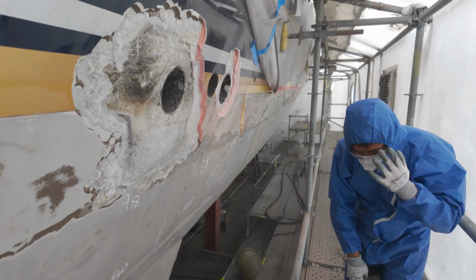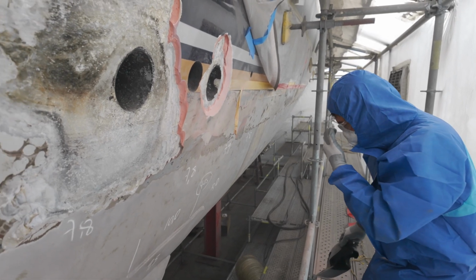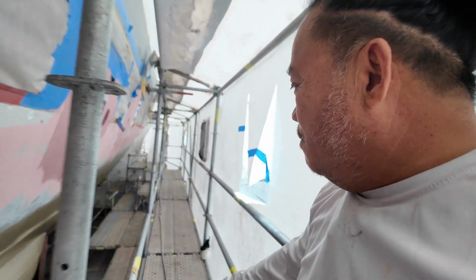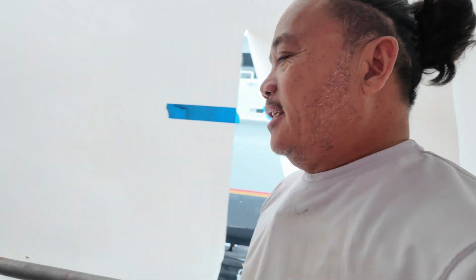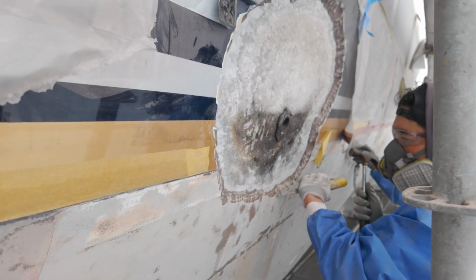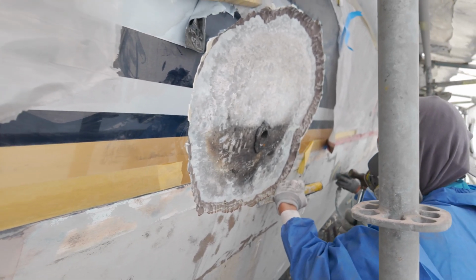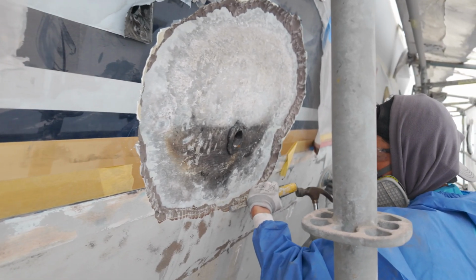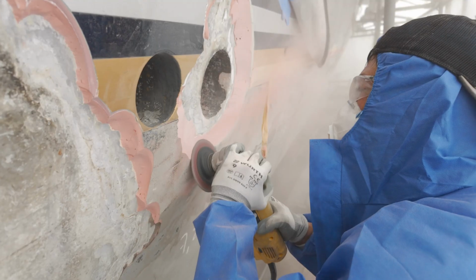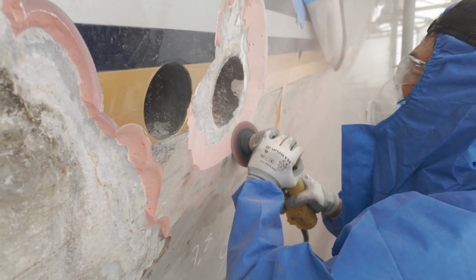As you can see, we started chipping some really big blisters from the exhaust, and then massive. We've discovered some really big ones earlier, which is this one now. It's pretty much full with filler. But one thing is, this big job that we're actually doing really takes fairing on that part of the ship. So the transition between the raw aluminum and the fairing is quite deep over there, so we have to fill it up. That's why it looks like that.